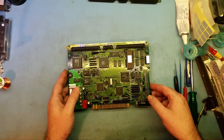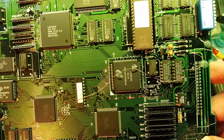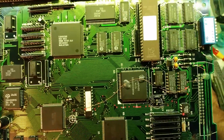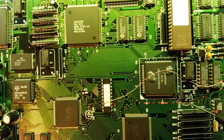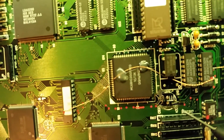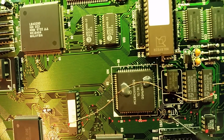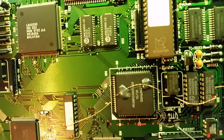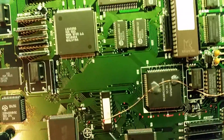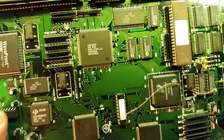That's the enamel wire I use — that's what you'll see on all of my repairs. Now the next one is a little bit trickier. From my other videos, you'll know the caps leak. This is the cap right near the processor. You can see all these tracks around it get eaten — it just destroys the board. There's a track just here underneath a via for the cap that gets eaten straight off. To fix it, you go from three up on one side all the way across to one, two on the other side.